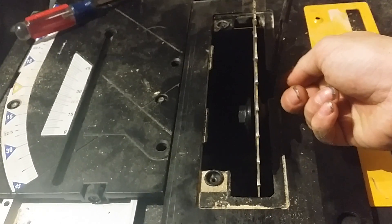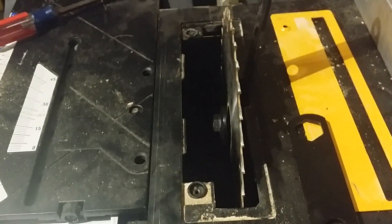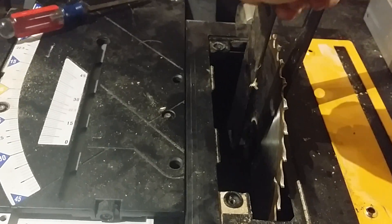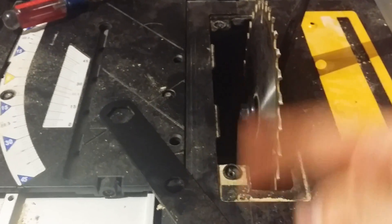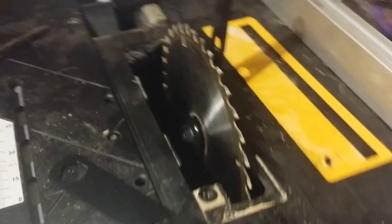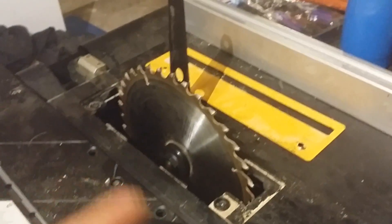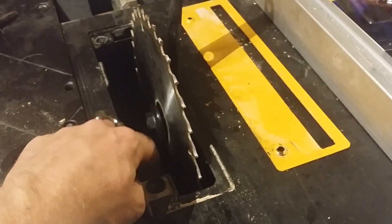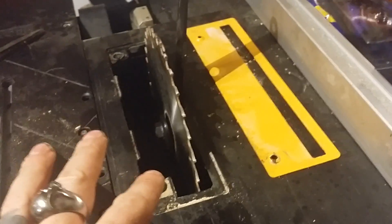While I'm at it, I'll show you guys how to change out your saw blade. What you're going to do is take this bit off, because that's how you're supposed to do it — raise it all the way up, and then you have two wrenches. This one is very nice. Another cool feature down here: there's a little spot for you to store it with a little locking handle to tighten that on there for your spare blades. I did put that one over there just because that's where I took it out of the package, but I could keep it underneath in that one spot.